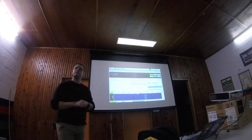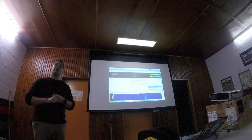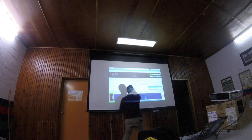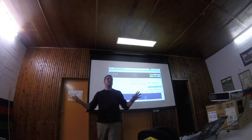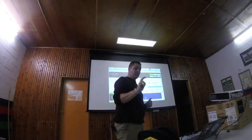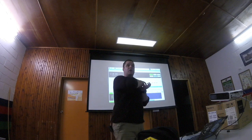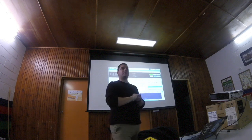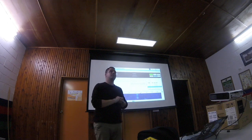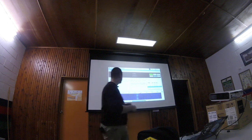Is there any error correction? 100% forward error correction. So if I had got dot, dot, dot, dot and no diamond, that's an indicator we're missing half a message. I can either right-click on Pete's call sign and say again or AGN question mark, and the computer will just send me everything he sent before. We're missing the last bit, etc.